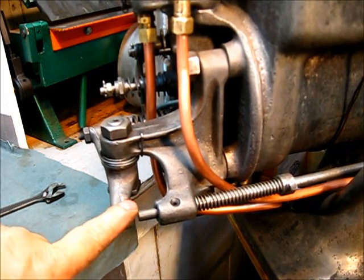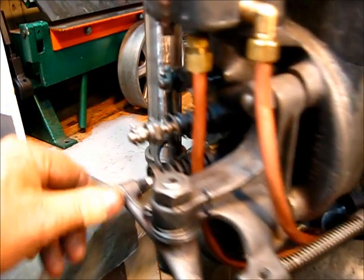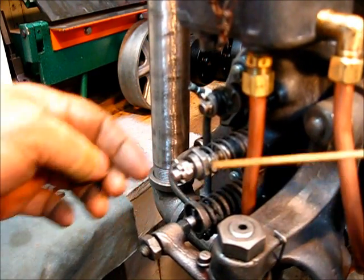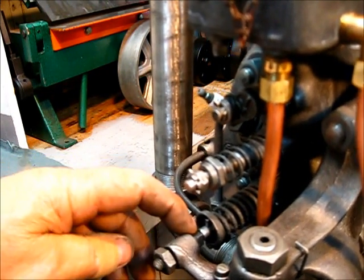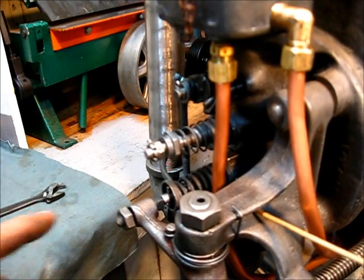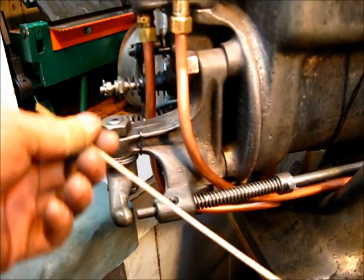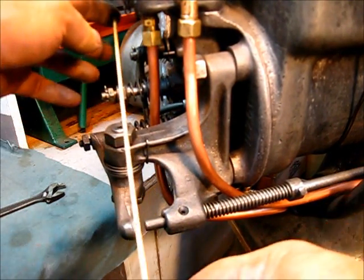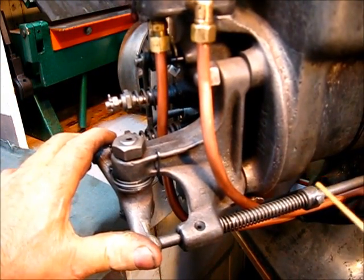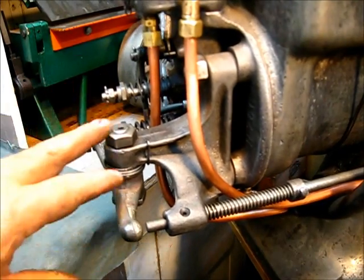The flywheel is in the same place. I've got quite a gap right here. This adjustment screw and the lock nut is adjusted toward the front, meaning it's as short as it can get, so that it will have more travel to adjust in the future if need be. I wanted the rocker arm to be in as near a straight a position in relationship to the engine as I can get. I could shorten up this rod and run this screw way out and put that in a different position, but it's just not right. This should be in as near a level position to the engine as can be, and you can achieve that with the adjustment we're going to do.